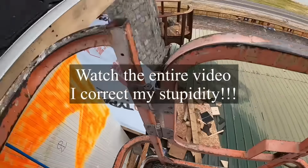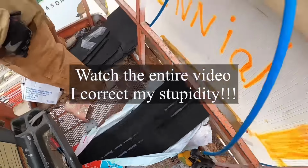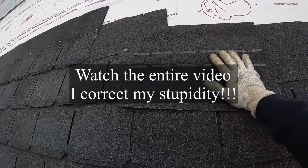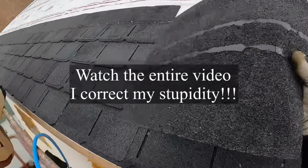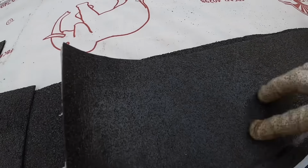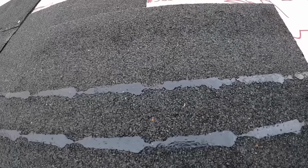There's a couple of different options. You've got this option here, which is a short piece of those long pieces you see right there. You can see the tar strip is here in the middle. And that's not my preferred, but the shingle supplier, this is the type of starter they had. This is the type of starter that I prefer, and it's a peel and stick, basically. And what I like about it is it has the tar strip real close to the edge. You can see when I line these two up here,